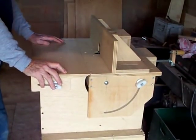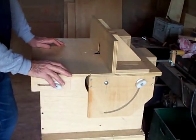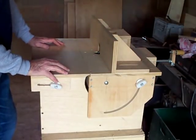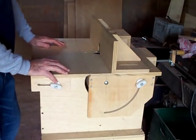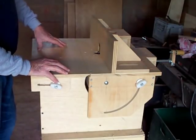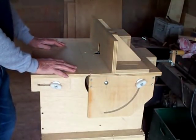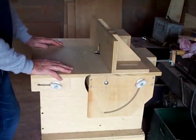This is my adjustable router table. It goes from vertical to horizontal and anything in between. I originally built it for some cabinet work on some odd angles I needed to spline together. I also use it for columns to spline them together. I also use it as a secondary router table if I have more than one procedure on a routing project.